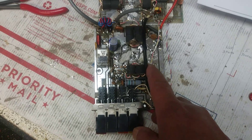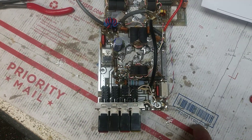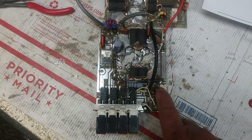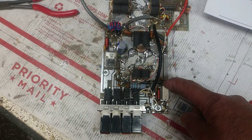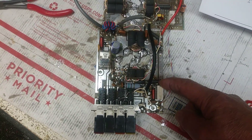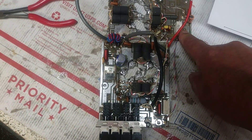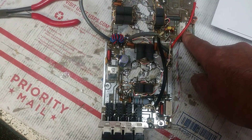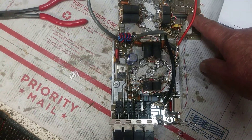The resistor was gone here, and you had 10 volts — a little over 10 volts on this side for the bias. Not .10 — 10 volts. You still had .8 here on this side, so the resistor was still good.